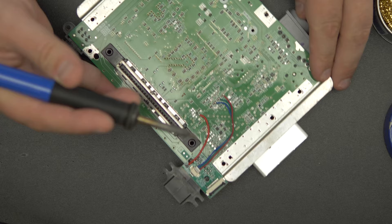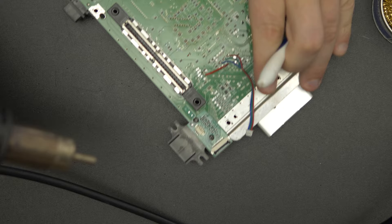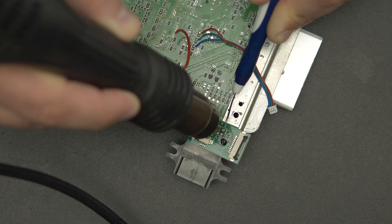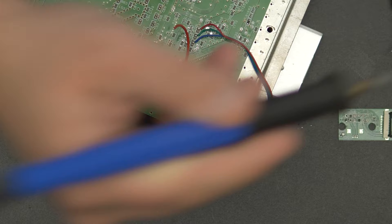There is a light at the end of the tunnel. As long as you're not afraid of doing a little bit of modding, I can make these kits not suck. Start with the completed unit: the first thing you'll want to do is remove whatever piece of junk board they installed. You'll probably need a heat gun for this, and it could be a bit complicated for a beginner. While heating the board, I had a pick underneath but was not pulling up — I simply put a tiny bit of pressure on the bottom side, and when the solder got hot enough, it came right off. Definitely do not pull, or it could harm the motherboard. If there's any excess solder on the pins after removing, just use solder braid and a soldering iron to clean it up.